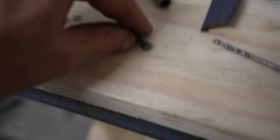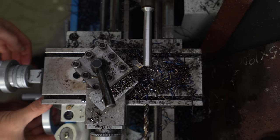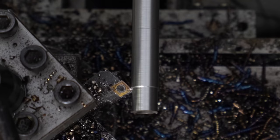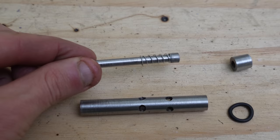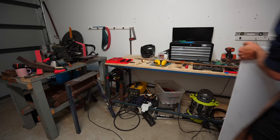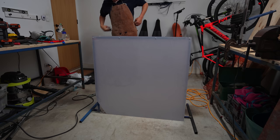I really should have had more foresight, knowing that the mild steel would misshape and give out like this, which now means I need to make the whole thing again using a stronger steel - this stuff here called 5160 or similar. So I remade the whole device again, and I also made the piston much thicker, which should now hopefully survive. But in case it doesn't, I'm going to skip doing another safety test in the vise and go straight to testing by hand to see what it does to a pool ball and pool stick. To do this, I bought a material called polycarbonate and welded up a frame for it. I'm fairly confident this should protect me from the rounds and explosion, as it's what the Mythbusters used and as far as I'm aware, they ain't dead.